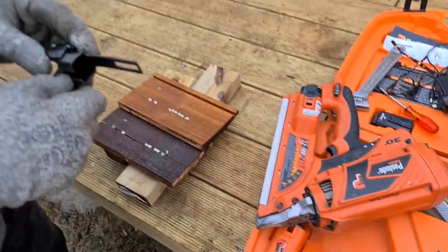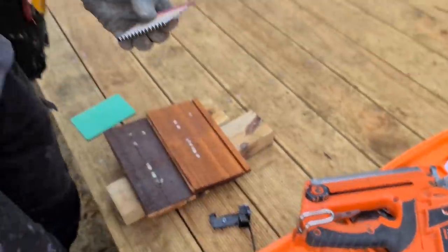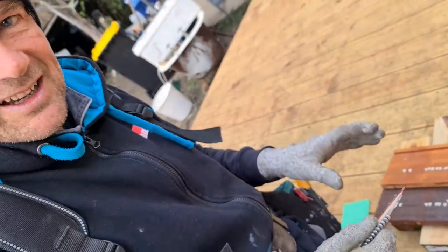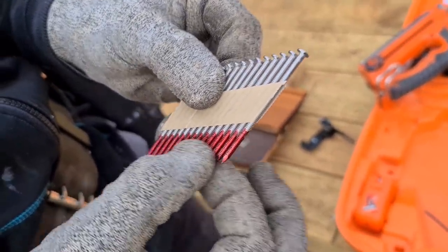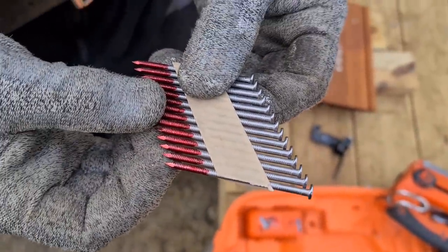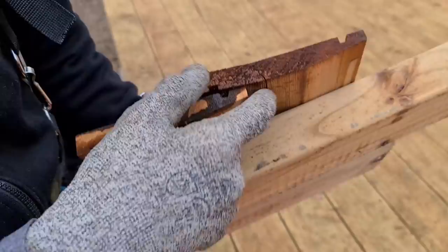So this morning I've got this special tip for shooting stainless steel nails into the weatherboards. It's a bit of a tricky thing, but I want to be able to repeat the same position for the weatherboards and I want the nails to go the same depth. Doing it by hand doesn't actually do it as well as when you do it with a gun. These are the nails I have — they're stainless steel, they've got ribs on them.